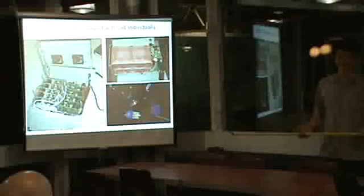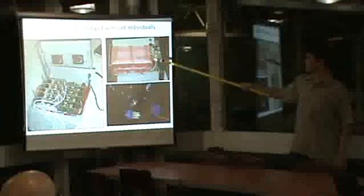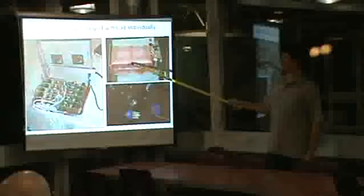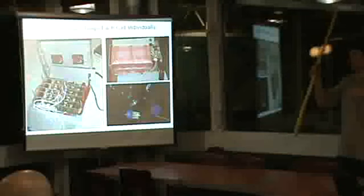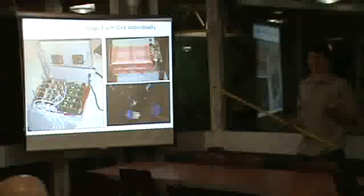So when we were first getting into lithium packs in 2004, there wasn't a whole lot available in off-the-shelf battery management circuits. And as a way of overcoming the fact that you needed to balance these cells, a lot of companies at the time weren't supplying any management circuit, but they provided you with a battery charger that had 10 separate chargers in it, and then it would individually charge up each of the 10 cells. And that way, when you charge the battery, you don't have to charge all the cells at the same time. When one cell is fully charged, it can just stop charging because it's got its own charging circuit, and a cell that's flatter can sit there charging for longer. So great, now when you're charging it, you can bring all the cells into balance.